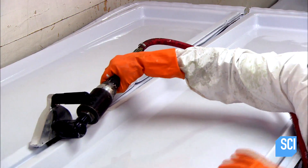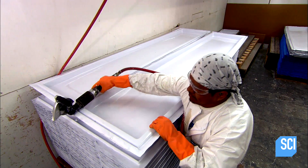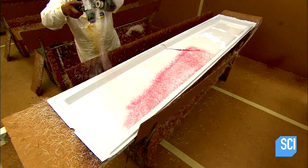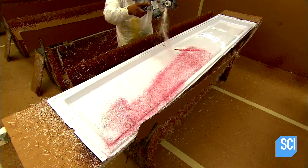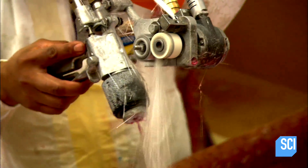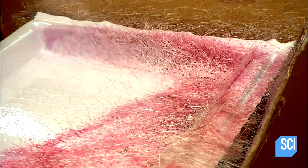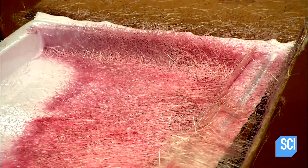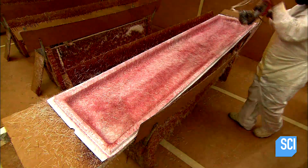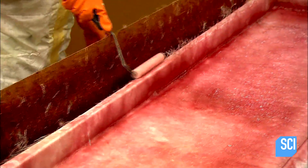They extract the molded acrylic, then split it in half to separate the two diving board shells. They coat the shell surface in a resin and fiberglass mixture. This tool is called a chopper gun because it chops and shreds the fiberglass string, then shoots it out drenched in resin. They roll it to compress the fibers and push out air pockets. Any trapped air would create a weak spot in the diving board.